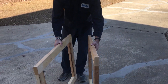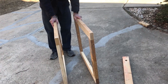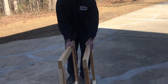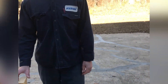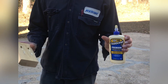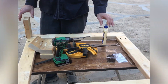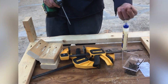All right, at the height of our table now. We're going to go ahead and put in our seven inch pieces in between and start putting this baby together. We're going to put these seven inch pieces in between our two frames that we've already built. We'll be putting a little bit of Titebond glue on here and assembling that, then connecting it with our pocket hole screws like we did before.